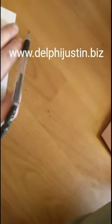That's how we're going to do it. So first I'm going to find my way to put that thing. I'm going to cut it back up to here because it makes testing a lot easier when I have my BNC connector hooked to the F-jack. The F-jack was used on TVs for antennas, but you probably have a cord laying around. If you have a TV that has a coax cord and you don't use it anymore, you could probably use that one.